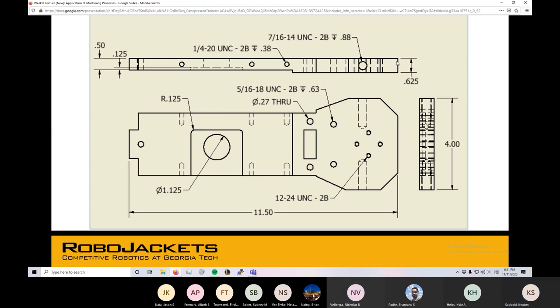What else? Next after finding the material? Just operations in general. The border is probably either CNC'd — I don't know if the CNCs are in the common machining area, but generally probably mill for the outer dimensions, for all these angles and really just the entire border. We do have CNC machines in the CMA. Although with this kind of plate, it's actually pretty easy to water jet this profile if you wanted to — it really saves a lot of time. Water jets would be a good call.